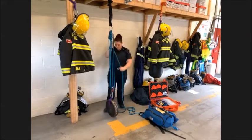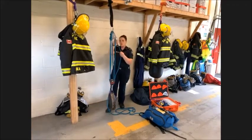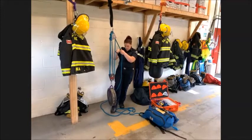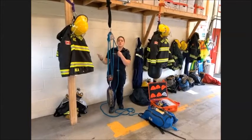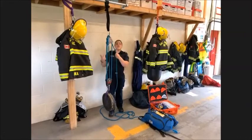Okay, so now, weight to the ground, turning here. 1 foot, 2 foot, 3 foot, 4 foot. Now my 4 feet here gets me my 1 foot there. Last time I had to do a fifth one to get that 1 foot of movement. But 4 feet of pull for 1 foot of lift.